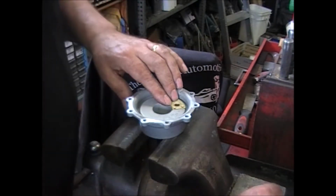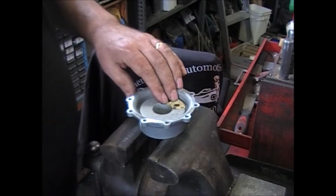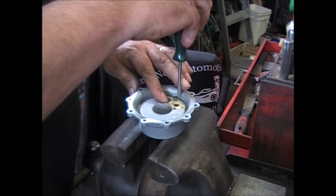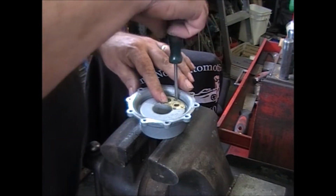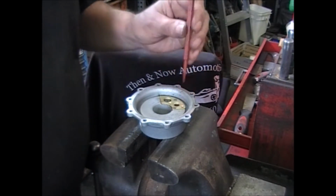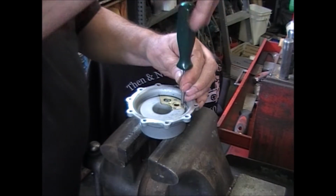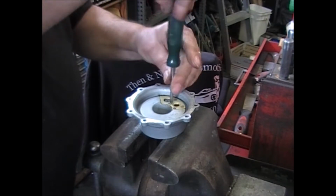You can't see it, but the gasket moved, which is not a big deal. We can straighten it out. Get one of the screws caught. 2 if you can. This is not a job if you got shaky hands. Now I just have a little tool that I use to line up that gasket. Drop the screw in and the other one. Tighten them down.